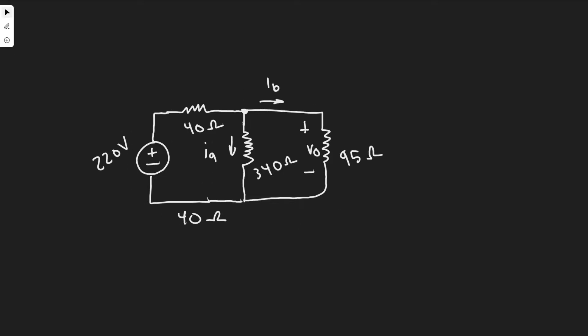The first thing we're going to recognize is that we want to solve for Ia. We know Kirchhoff's voltage law, meaning we can sum up the voltage. But we can't have two unknowns — if we don't know the current through here, I'm going to call it Ix. We need to solve for that first, because when I sum this up, if we have Ix and Ia, we'll have two unknowns and can't solve. So we're going to solve for Ix first.